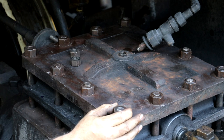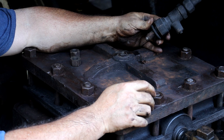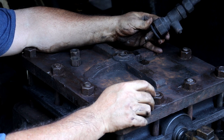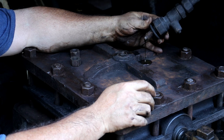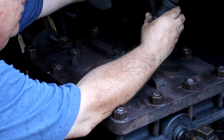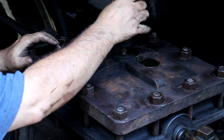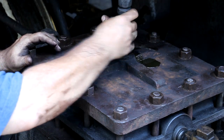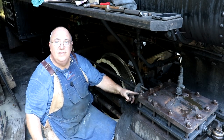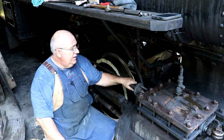Oil's coming out — it took 60 turns. Our protocol is usually 100 turns when firing the locomotive, so when we're starting up we hand-turn it 100 turns to get oil into the cylinder. That is working as it should. David's going to go ahead and start packing this gland up here — it'll take a little while. While he's doing that, I'm going to start getting her steamed up. We'll bring you back once we get some steam on here and check for leaks and make sure everything's working like it should.